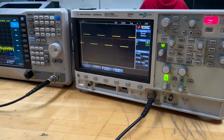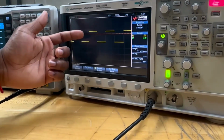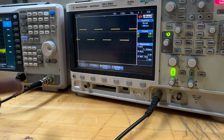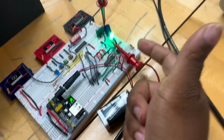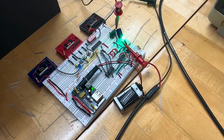As you can see, we had to create an astable clock. That's gonna create a square wave. So that's on, that's off, that's on, that's off. It's running at a frequency that's less than 1 hertz, and we have 3.8 volts peak to peak. So from this clock, we're running into a JK flip-flop to produce a counter. It's a binary counter that's counting from 0 to 4.